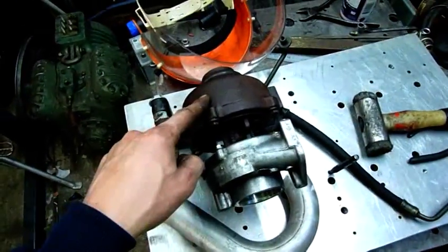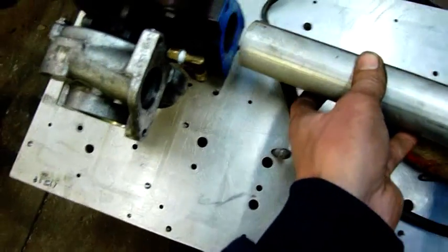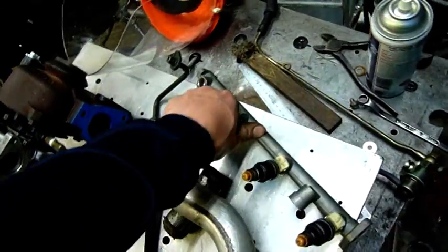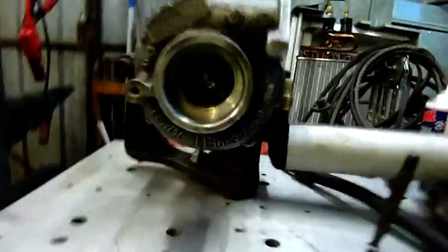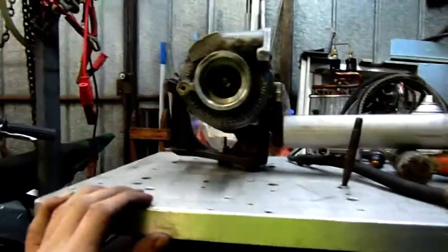This will be the compressor turbine, this will be the combustion turbine. So essentially, if you can imagine a flexi hose or rigid-and-flexi hose going to the two with a fuel injector in there — like one of these — it should work all right. We'll use a regular EFI injector if I can, just stick it in there, find a place for the spark plug. I'm guessing combustion starts just before it gets to the turbine. It's a Garrett variable vane turbocharger, meant for a turbo diesel, but we'll see if we can make it work — or at least melt it. I don't care if it melts, it costs me nothing. Any free turbo is better than none.